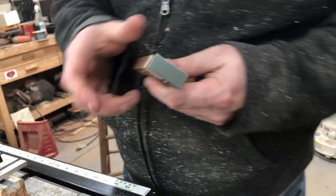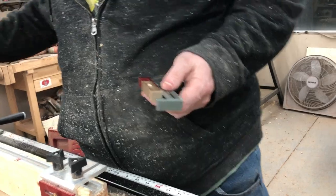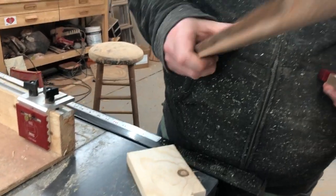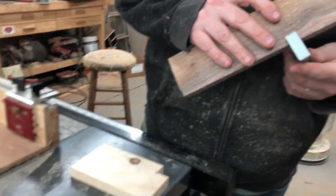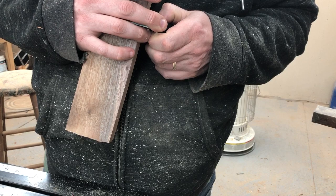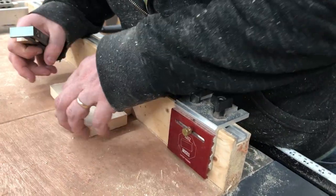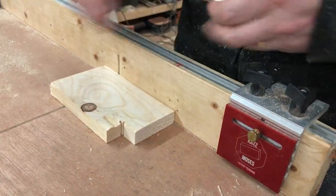That sets the kerf, and you may have to go back and forth just to get it fine-tuned. Then you would come up — we're going to say this is what we're running our dado through. We're deciding we're going to put this piece of walnut in there; it's not going to stay there. You would take your material, put it in there pretty snug, then lock that down. Then you decide where you want to run your dado through — for me, we'll start right there.